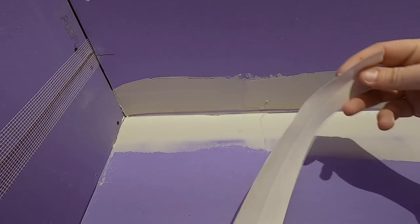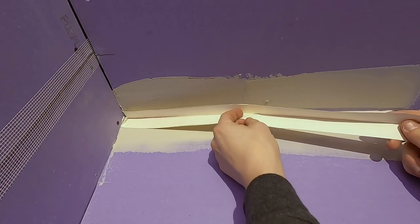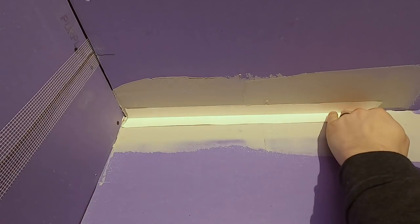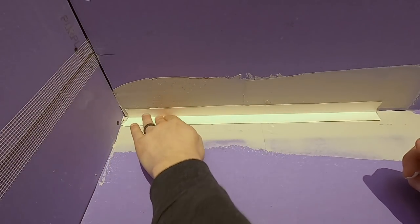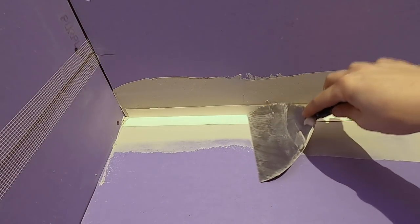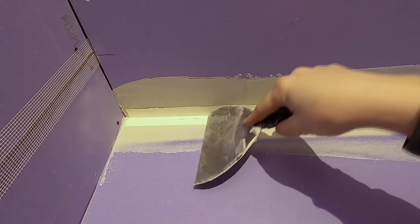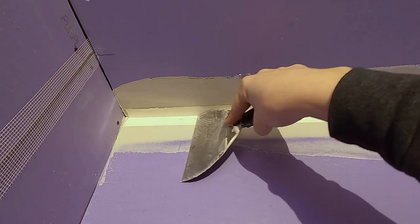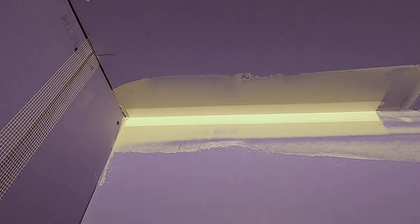And then you take your tape and you make a seam like this. Stick it up there. Doesn't have to be perfect in the corner there, because you're going to put another piece this way. Stick it up there like that. And then all of that extra mud behind the tape, you want to kind of squeeze out. And that's what's going to make the tape stick. A little air bubble there. There we go. Both sides. And that looks pretty good.